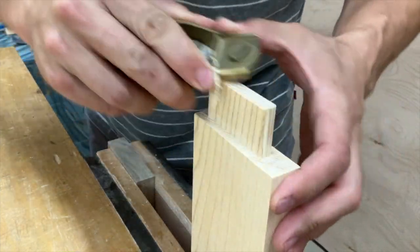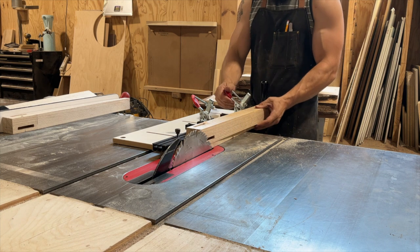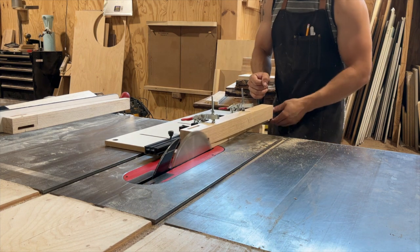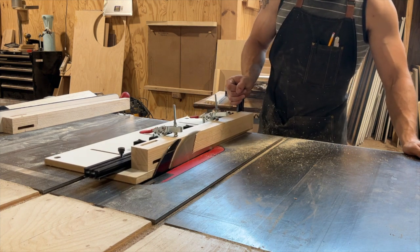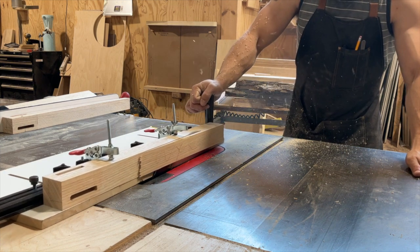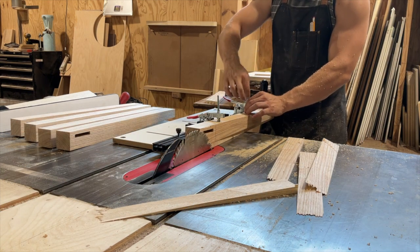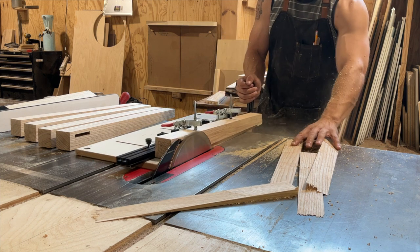I personally like to go relieve the bottom corners of my tenons — that's just a personal preference to make sure nothing gets bogged down when gluing up. Then it's time to cut a taper on the leg. There are a bunch of different ways to cut a taper: you can make a routing template with the Shaper Origin, or if you have a tapering sled like this, you can simply cut a taper quickly. There's a taper on both sides of the interior of the leg — I cut all four on one side, then switch and adjust the jig for the other taper.